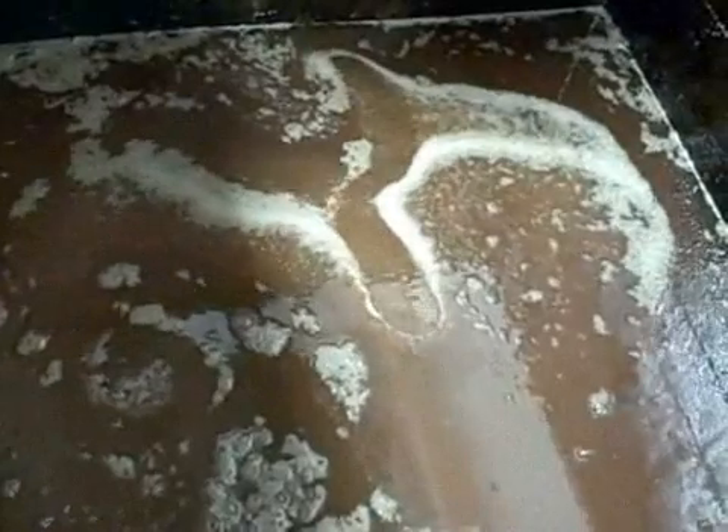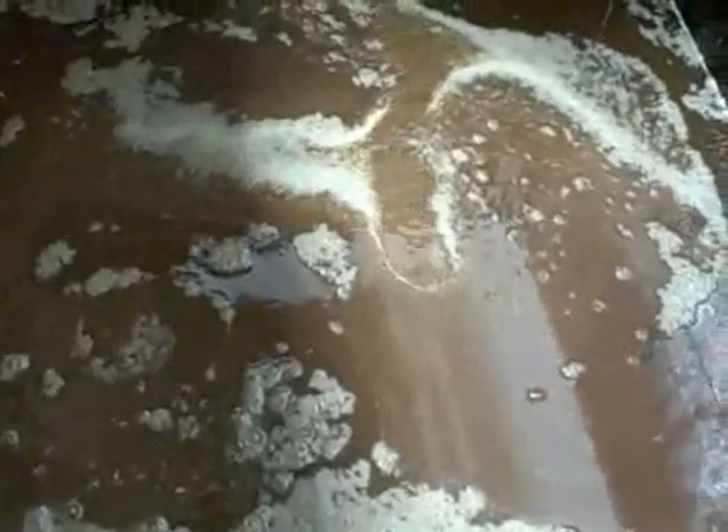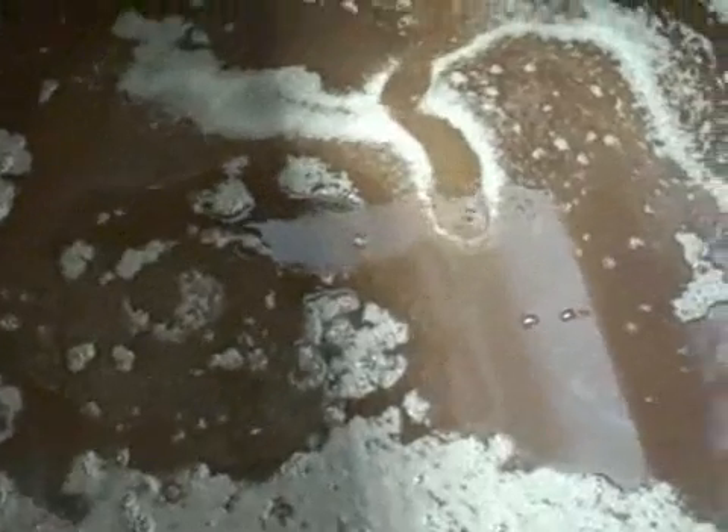Right now you can see the grease in the tank here is turning from the 4500 watt element, and that is going to cause the water separation. When you see the bubbles go away, those bubbles are primarily moisture and oxygen trapped in the grease. When those disappear, then we have all of our water separated and we can go ahead and go to the next step.